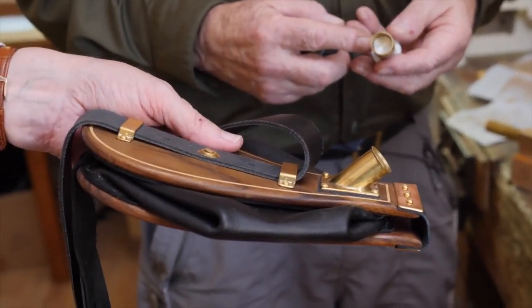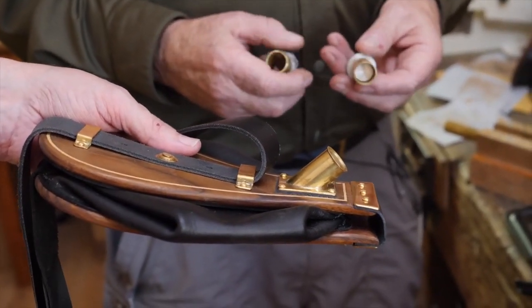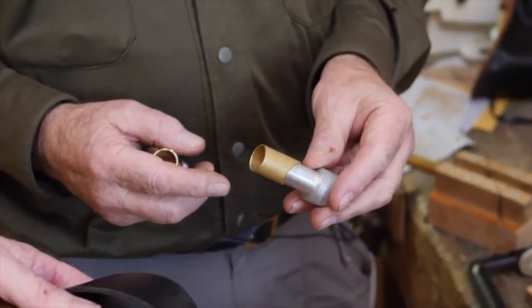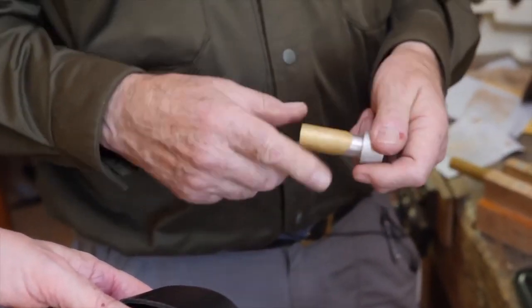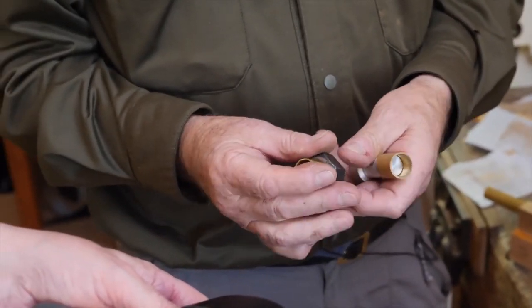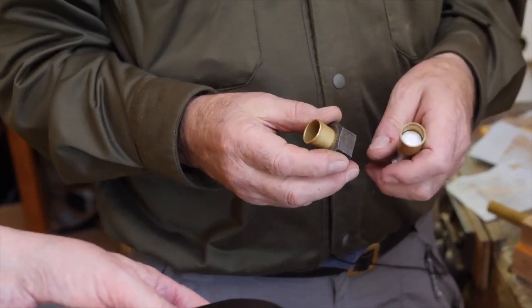So when you've finished tapping it to get that flare, you then take it out of the vice, put it on that mandrel that you've got it on, and it just pushes onto that, slightly tapered. Yes, it jams on. And then that'll go in the lathe, spin it round, and then you can tidy it up a little bit. Endways on and sideways on, and it makes a much neater job.